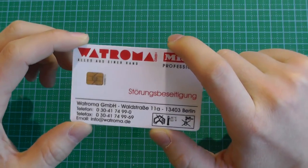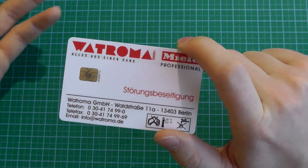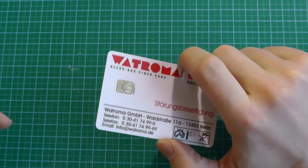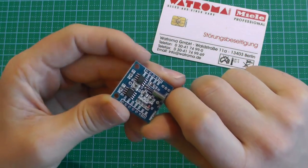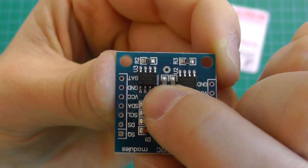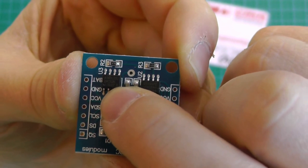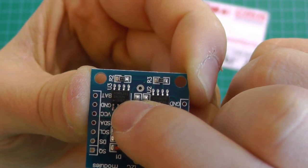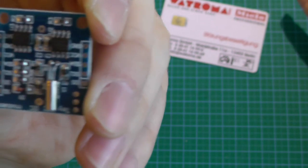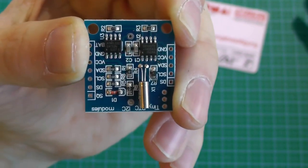So that's a problem. Now we know the protocol, and we know this is simply memory, which you can talk to using the I2C protocol. And memory over I2C is pretty common in the microcontroller industry. Actually, you use I2C EEPROM. Like on this board, here on the left, you see there is an ATMEL chip, but this is simply I2C EEPROM, and you recognize it with the part number 24C32. 24C is somehow the class telling this is I2C EEPROM, and 32 tells you how many kilobits you have. I think 32 stands for 32 kilobits, if I'm not wrong.